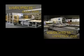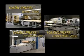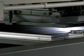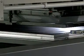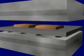The operating principle of the Wehmhörner VarioPress lines is the same for all three models of the range. After the collated materials to be pressed have been moved or placed into the press, the press is closed. As the press closes, the pressure chamber is locked and the thermoplastic foil is automatically fixed.